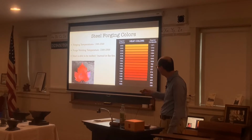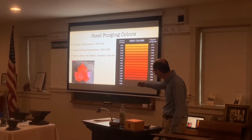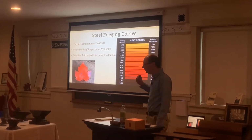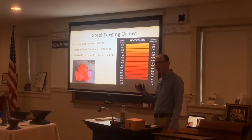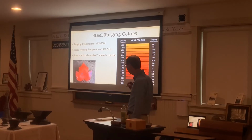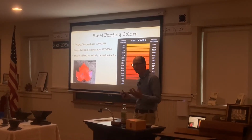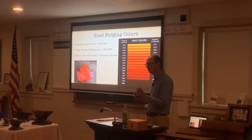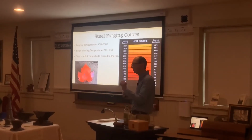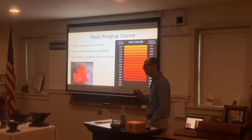And then here's a little spoon rest I made, which is right around 1,500 degrees Fahrenheit. And then you can see these little pieces of black spaces here. Those are called scales. As you're hammering, you probably notice there are little pieces of metal coming off the metal that I was hammering. That typically happens because of oxidation, which is basically rust, but it comes off as you're hammering. It just naturally happens because it has layers on the different pieces of metal. It's micro chips of metal, but it'll still happen naturally.